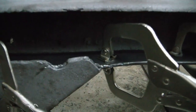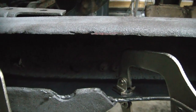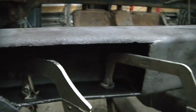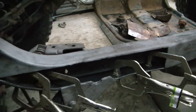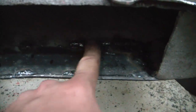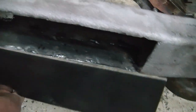The next step is to weld in a piece of strapping on the top of where this frame is pretty bad. Now this isn't ideal because there's just going to be rust growing in between these two pieces, but this bottom piece of the frame is just so thin that it'll rust out pretty soon. So I'll put this backing behind it and give it a little more strength. I've got this brace tacked into the bottom of the frame rail, and the piece for the outside panel here has been fitted — it fits right in there real good.